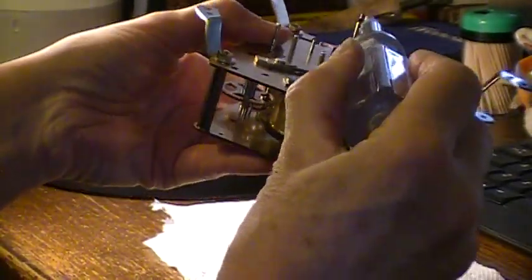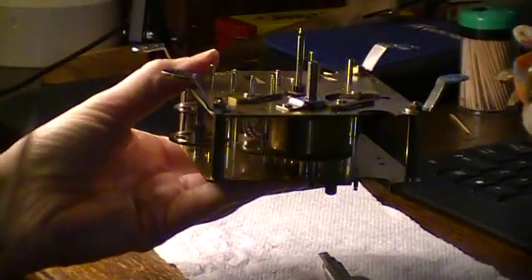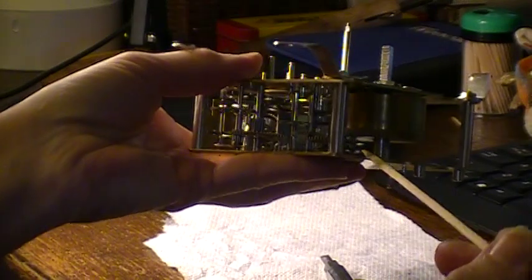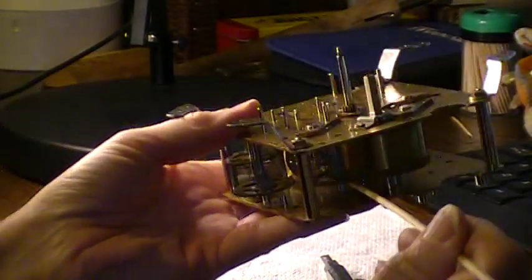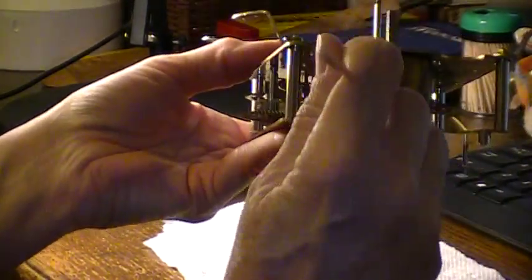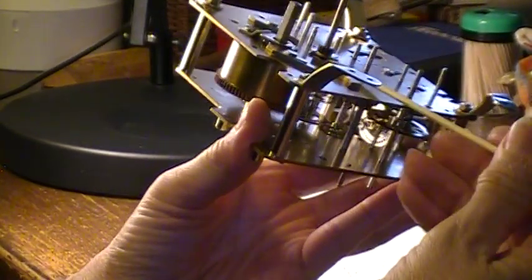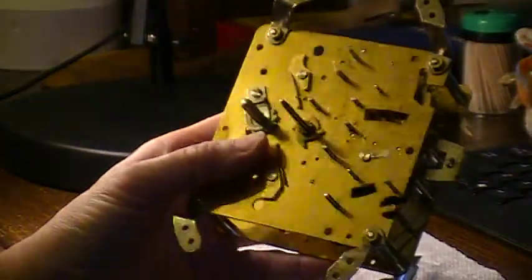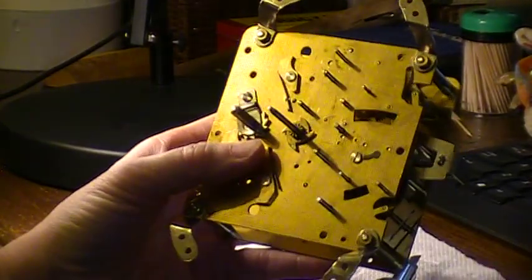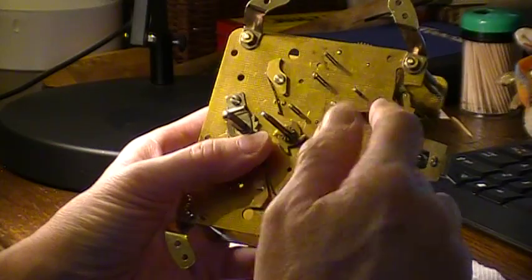The other end of this pipe is this gear that's got the spring on the bottom of it. There's a shoulder on it - when you seat it into that hole you should have some end shake; the shoulder should go in and out a little bit. The pinion should be in the hole when it's bottomed out. Make sure you have a little gap underneath there, because I had the clock all put back together and had the same problem as before - the little tab that was getting lifted was now going over it, not hitting it, and nothing was happening.